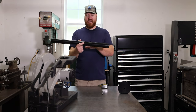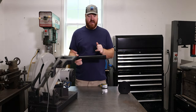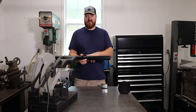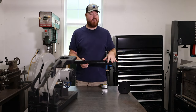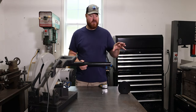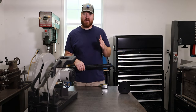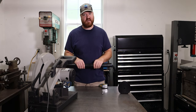So it'll come out, go this way, and then come out again. I'm gonna do the cuts at 1.25 and then at 11.5 inches. And that will set the monitors back about 8 inches. I'll rotate the parts around, set them up with some clamps on the table, and then we're going to MIG it. We're going to paint it, we're gonna bake it, and then we'll be able to get it installed back on the desk and get this project done with.